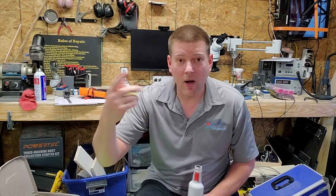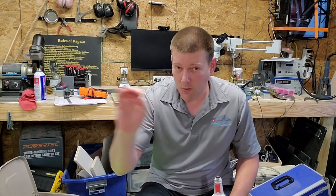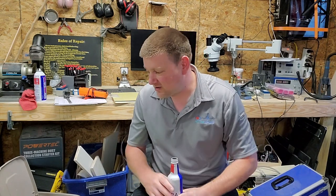So guys, when in doubt, always — always — when you are checking out a piece of equipment, start at its highest value, whether it's the speed for a motor, the amount of suction, the amount of dispersed energy, or whatever it is. Always start at the highest value and work your way down. Never start at the lowest and work your way up, because chances are you're going to shut the device off when it's on its max value and the user is going to come in, flick it on, and start using it on a patient when it's way too dangerous.